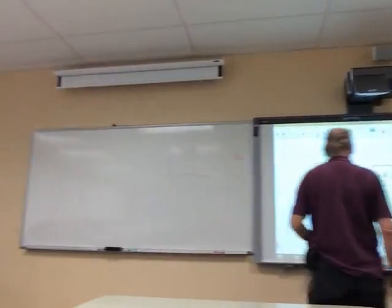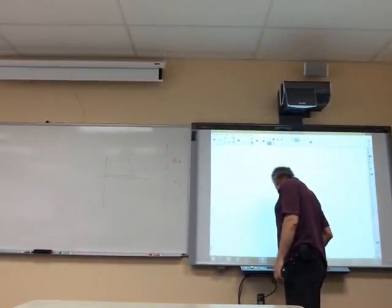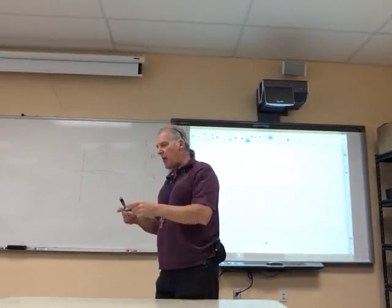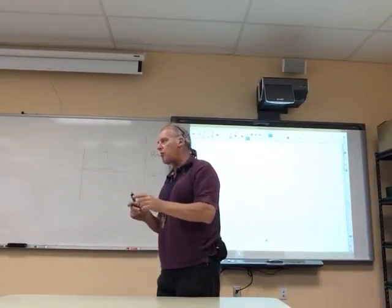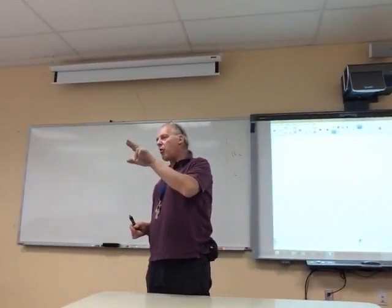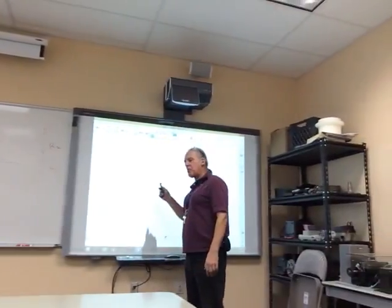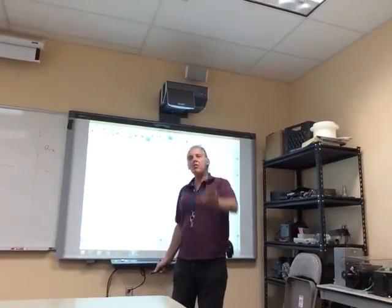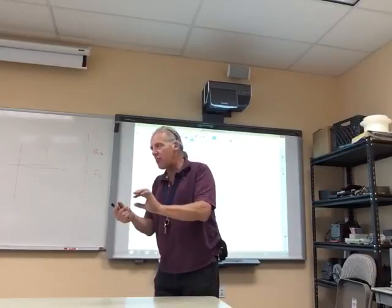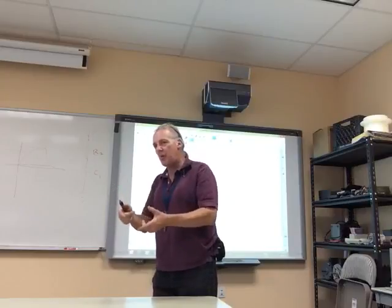Now, one more thing I want to talk about at this point in time. You need to start, and that goes for everybody, you need to start color coding your wiring. You need to start trying to make all the wiring for one particular thing a certain color and a certain length. So let's say the 4 bits that you're going to drive, let's say we make them all green. So the 4 bits between the 193 and the 7448, they're green. I can always identify them then. And if I make them the same length, or pretty close, I do the best I can, or at least group them together somehow. And I need to make them long enough so I can get the chips off the board and put another one on, because you're going to blow one up for sure.